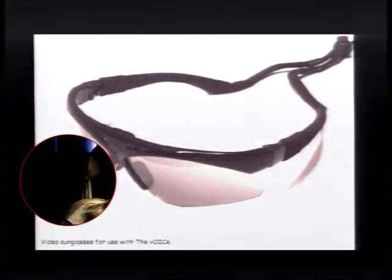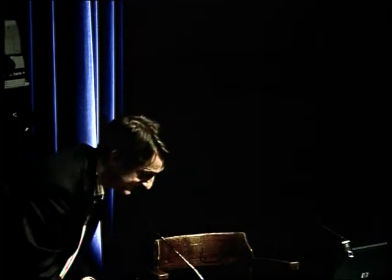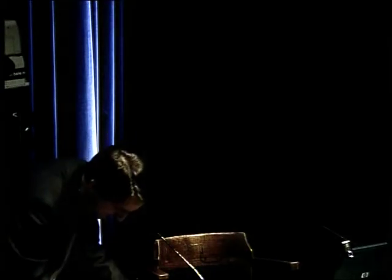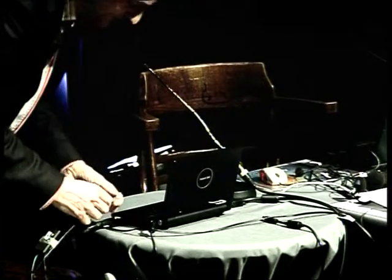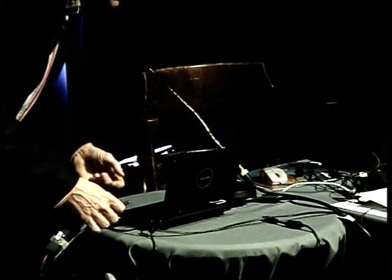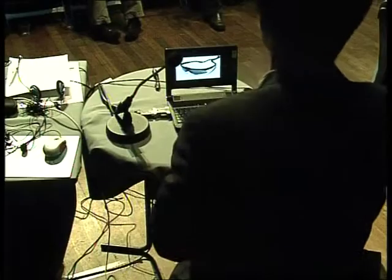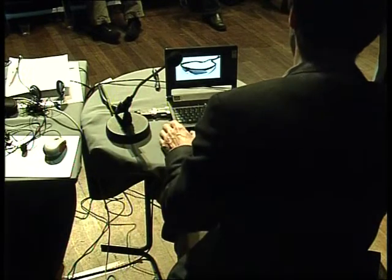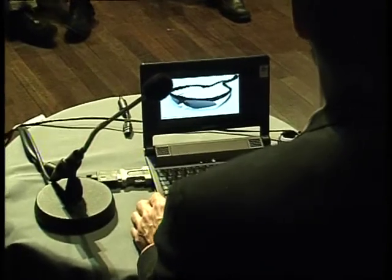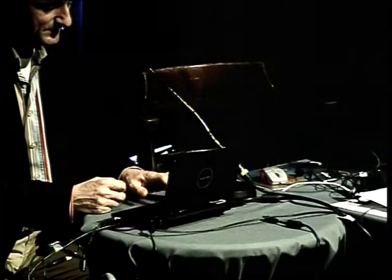What I'll do now is first plug in a power converter, because the USB gives you five volts and these analog cameras need nine volts or so. So now it's powered. Because these are analog cameras, they need an extra device to convert the analog video signal into a digital signal that the computer can handle, so I plug in a video capture device — that small block over there.